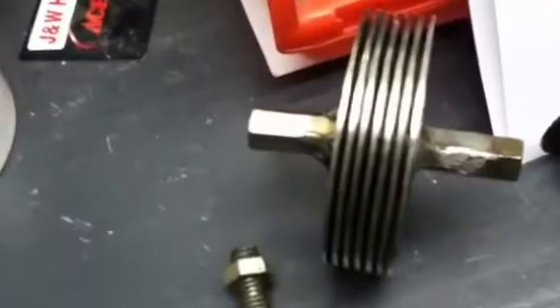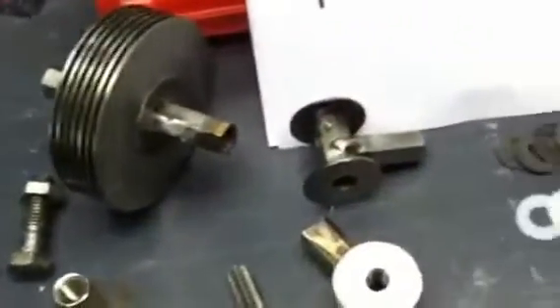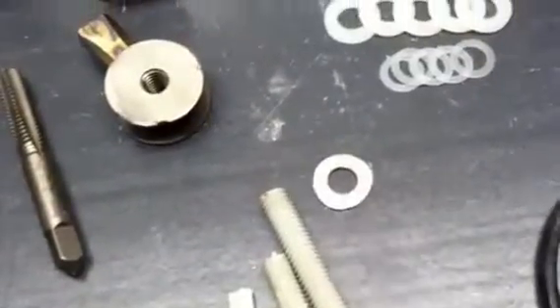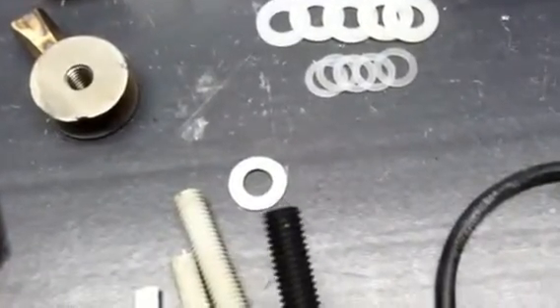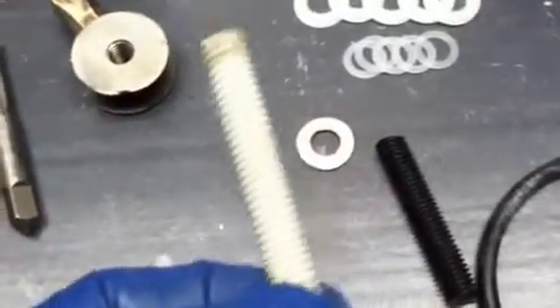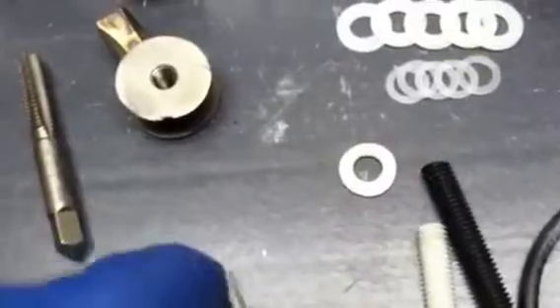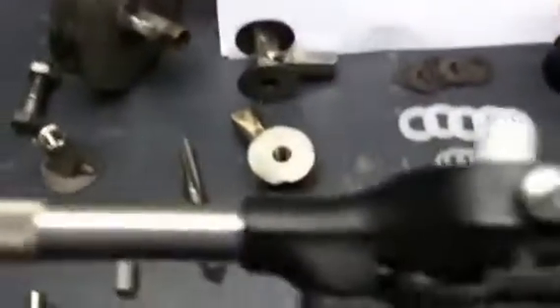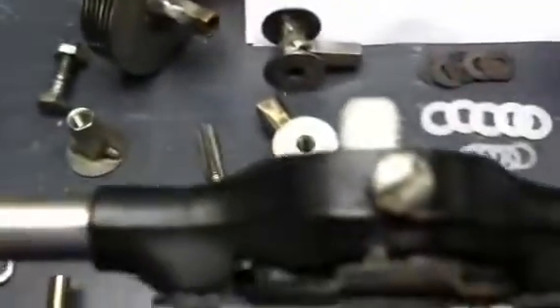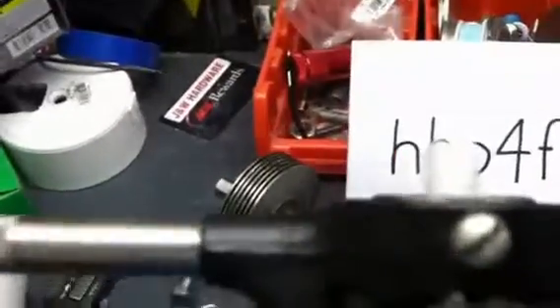For beginners, in the middle of the stacks there has to be a non-conductive rod in there — it can't be stainless, or you'll just short it all out. I tried some nylon rod; this is a black nylon. It worked pretty good, but it would snap when we put tension on it. And I tried fiberglass — this is twice as strong, nice and hard — but it was wiping the threads out, so I didn't like that one; it's a waste of money. So I found some acetal, which is working really well. That's what's in that stack over there. You thread it — it comes threaded or non-threaded. Ten dollars a foot un-threaded, fifteen a foot threaded.